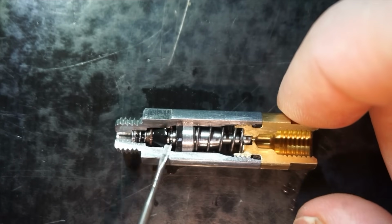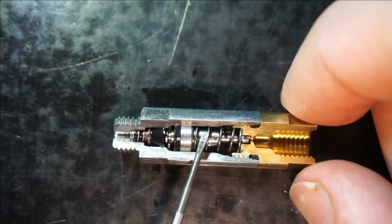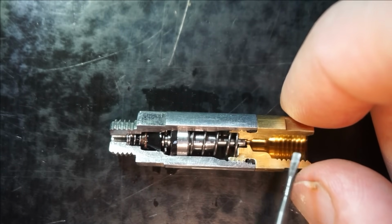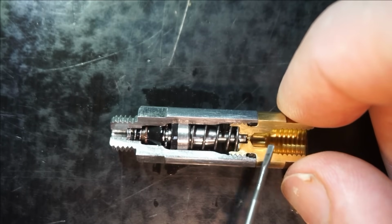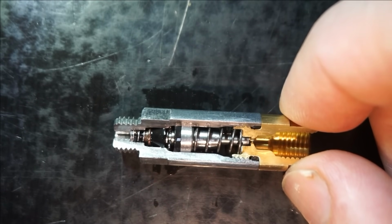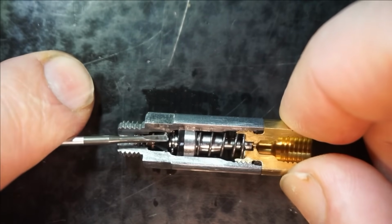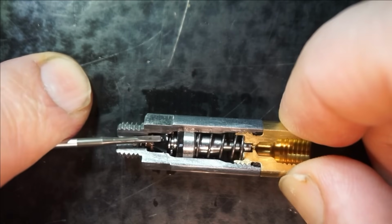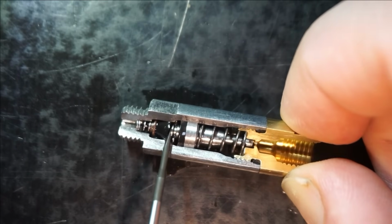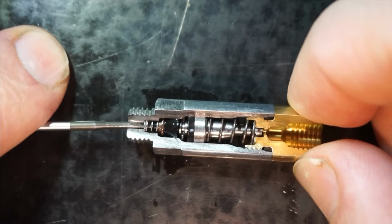I almost forgot to mention, as this is the initial configuration, then think of this chamber, the discharge port, and all the way to the oiling port, everything filled with oil, the center of the tube, and all the supply lines filled with oil. So oil comes in here, pushes this piston, opens the piston skirt to that side, so that's the first check valve function. And the rubber face of that piston closes the hole of the tube here. So that is the second check valve function.